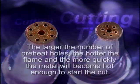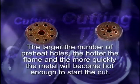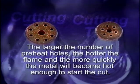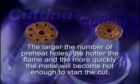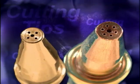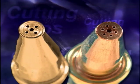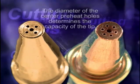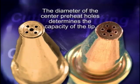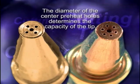The larger the number of preheat holes, the hotter the flame, and the more quickly the metal will become hot enough to start the cut. However, too many preheat holes may overheat the part being cut. For most general-purpose cutting, tips should have from 4 to 6 preheat holes. The diameter of the center hole determines the capacity of the tip. The larger diameter holes can handle higher cutting pressures, which are needed for cutting thicker metals.